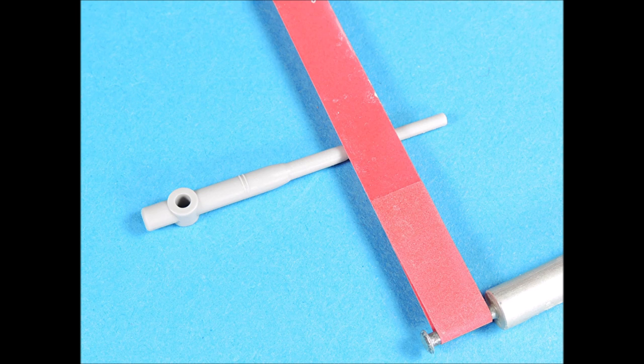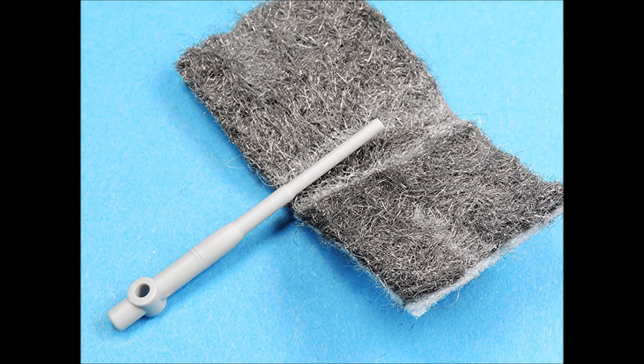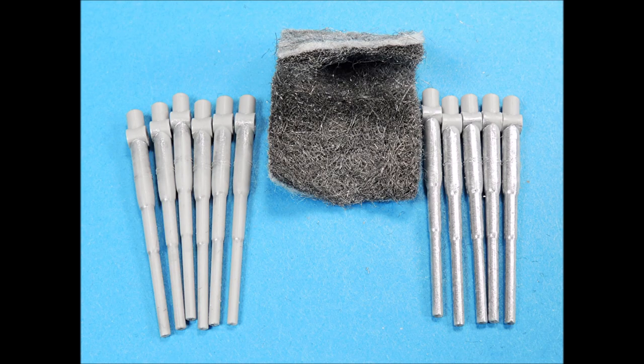One method to restore the shape of each barrel is to use a flexi-file — be sure to wet-sand the barrels and use very fine-grit sandpaper. Another method is to wrap wet sandpaper around each barrel and rotate the barrel around the inside of the sandpaper while slowly pulling the barrel away. Each barrel length should then be polished with a very fine steel wool pad. The barrel tips were slightly indented, but I deepened them with a 0.036-inch drill bit. The barrels were checked with silver paint and then cleaned with a very fine steel wool pad to remove all of the paint.